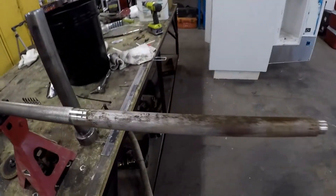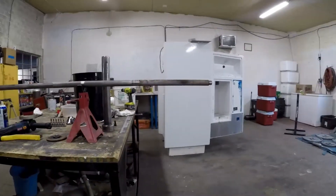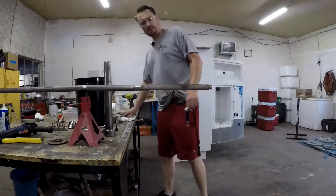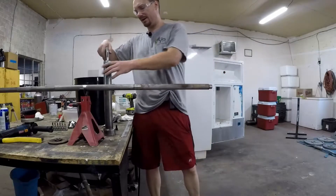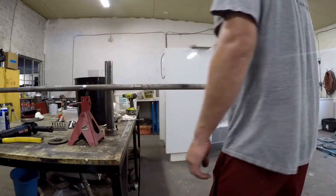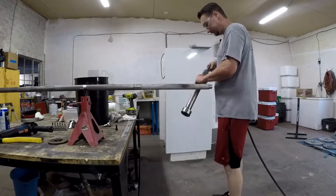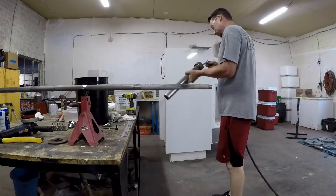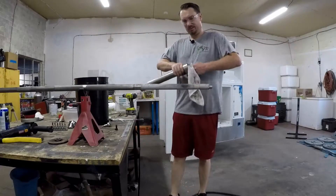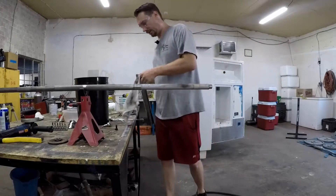All right, I pulled this one apart and it's worse than I thought — it's got actual rust just sitting in there. This side must have been sitting in the sprinklers when it was stored outside, back when it was still worth nothing before the lockdowns. I'm going to take this air gun and blow out the collar to get as much rust out. Then I'll wipe out the bearing surfaces, lubricate it, wire brush the shaft, and put it back together like we did on the other side. I'll be back after I get this all put back together.